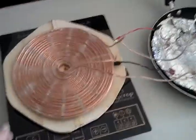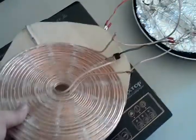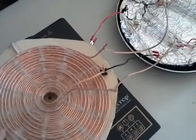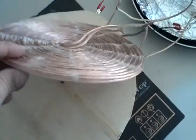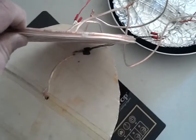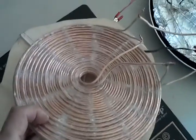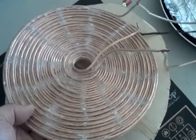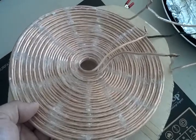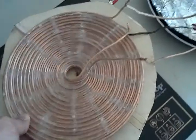I did make a new coil system to show you that wireless can work on this machine. You saw the original coil down below — that's about 230 micro-Henrys. This new one is wrapped a little bit differently; it's wrapped with the wire tilted on its side at 90 degrees, so you can fit more wraps on there. It has about two to three times more resistance and the inductance is twice as much as the original coil.